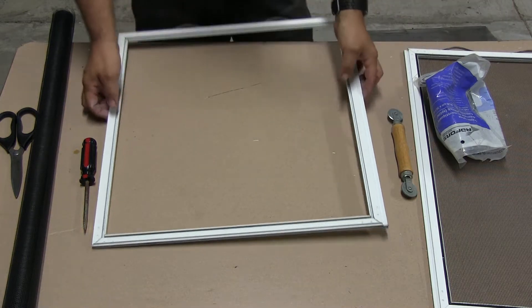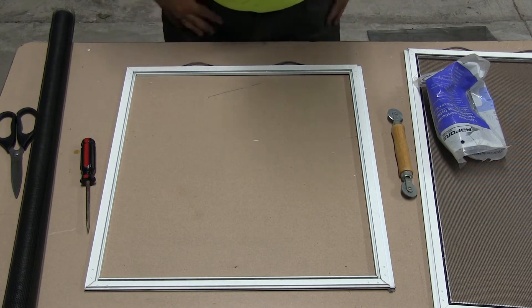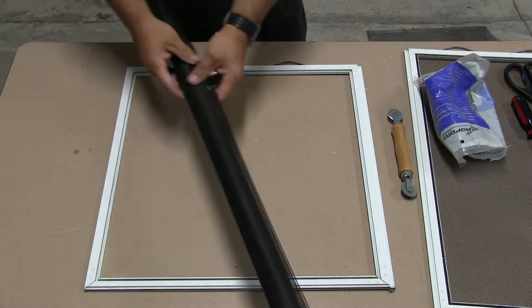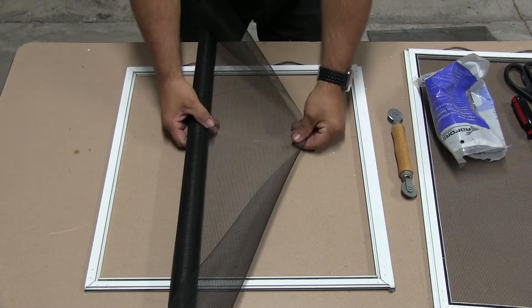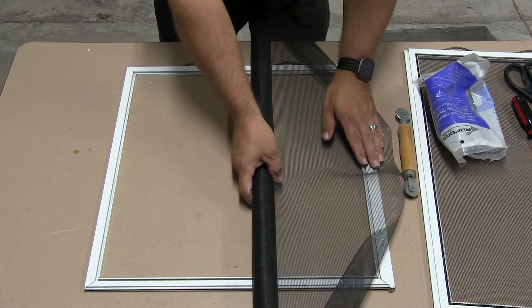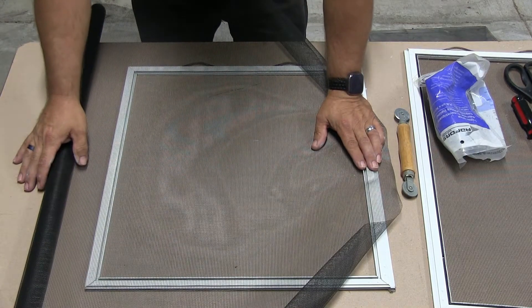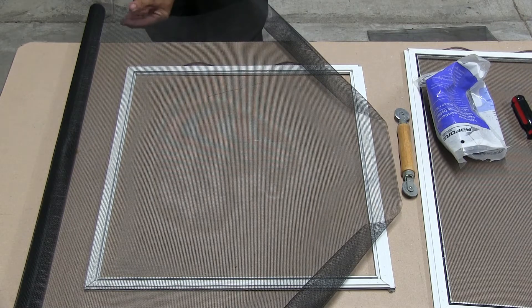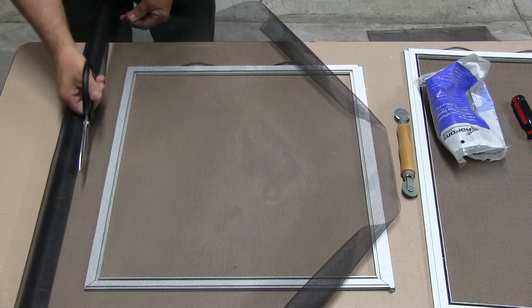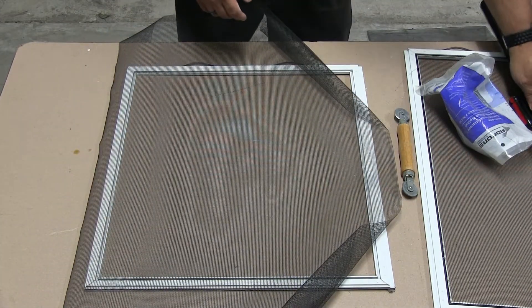Pop the little screen out. Now that that's away, get some of the garbage out of there — there may be some screen remnants or dirt or whatever; this is actually pretty clean, but there was a little dust. Two ways you can roll your screen out: you can roll it out like wrapping paper, but you're going to fight with it — you can see it's already starting to curl back. So put it face down, give yourself maybe an inch or two of leeway, and roll it out. I choose to cut it now just to have that roll out of the way.